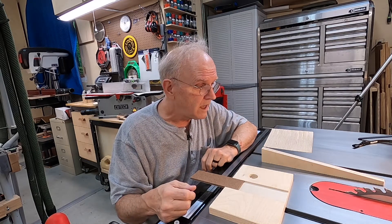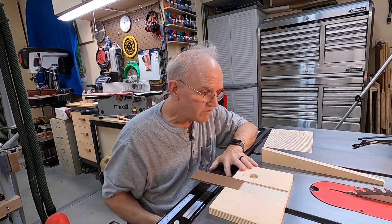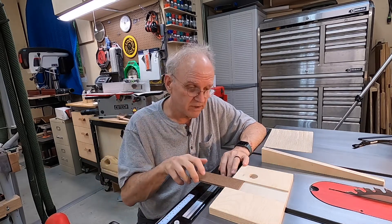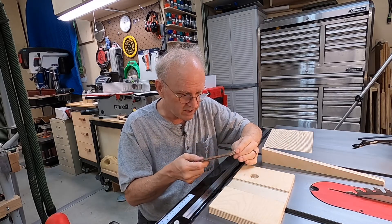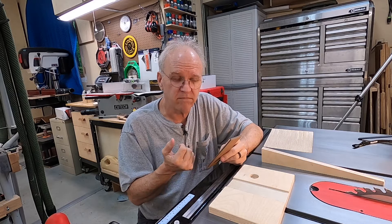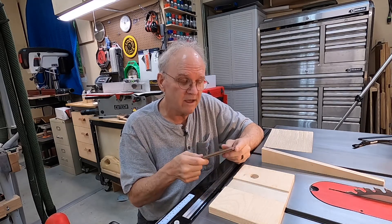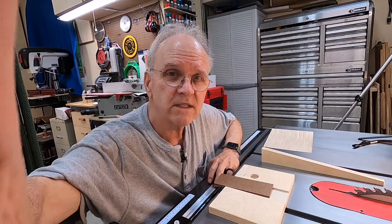In the next video I'll show you how I cut these angles with this saw blade — the blade will have to be lowered down until it fits just right — then show you how I clean out all the waste. I'll set up my shooting board on the other bench table and show you how I cut these things. I'll get close with the saw blade, probably leaving it a sixteenth of an inch too wide, and then shave it down with the shooting board. A sixteenth of an inch is actually a lot when you're cutting two thousandths at a time. Stay tuned for the next part of the series.